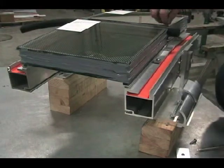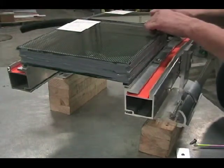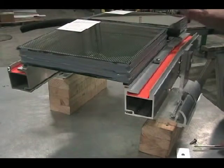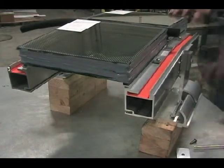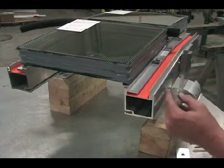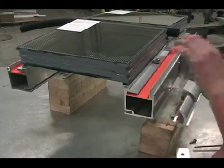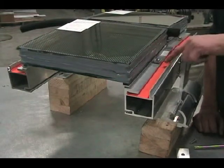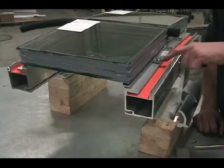So when you caulk it, you get a good bead of caulk between the two pieces of glass. There's an awful lot of big 3/4 inch caulk joints. Take your time and do them good, or it's going to be a nightmare piece. I don't have a sample when I'm making this movie, but it hooks in here and then snaps. I expect you're going to have to bend it with your fingers to get it to snap past this clip.